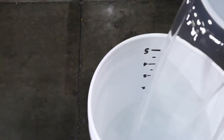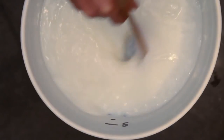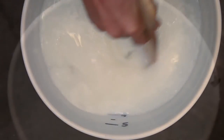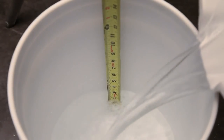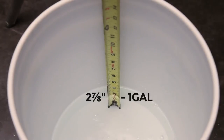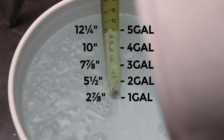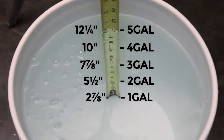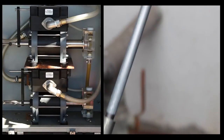If you're going to mix your coolant manually, a graduated 5-gallon bucket can be used to measure the water and concentrate you'll be mixing. These buckets are readily available for purchase online, or you can make your own by pouring 1 gallon at a time, measuring each increment up to 5 gallons, and marking the bucket at the measured spacing. If you want to mix your coolant in a quicker and more thorough way, consider using a proportional pump or venturi mixer.